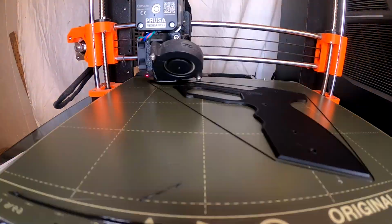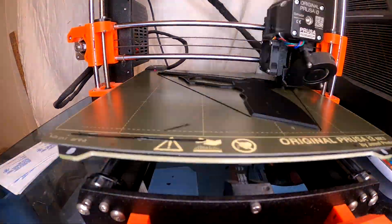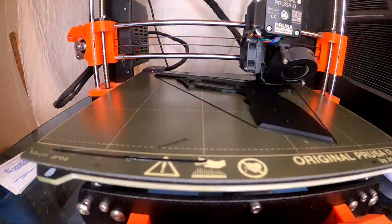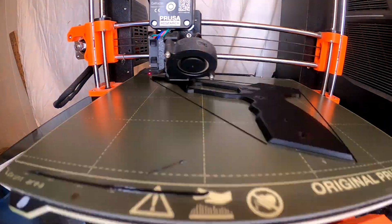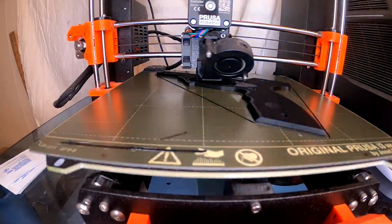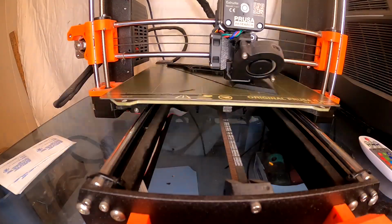The only parts I had trouble with were the string stoppers. They require laying down the outline of lots of small holes in the first layer, and for some reason they kept failing on me. So to fix that, I just turned my bed temperature up by about 5 degrees, and that fixed my first layer adhesion problems.